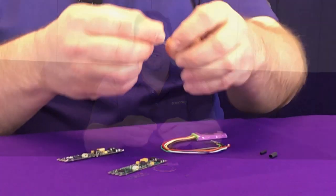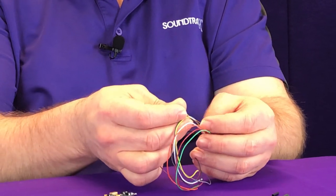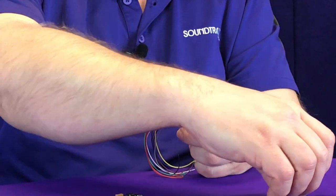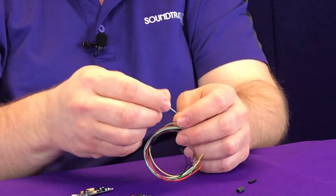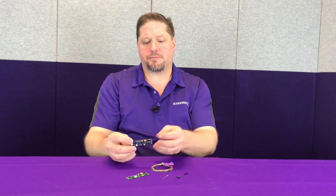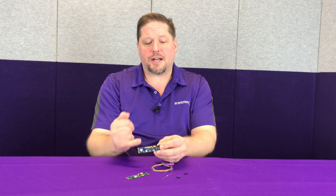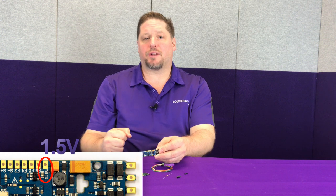The resistor, we just simply hook up inline on the white wire, and then make sure you get some insulative tubing and heat shrink tubing to slide over to protect your joints once you make the connections. On your PNP boards, these board replacement style decoders, we actually do have a plus 1.5-volt common that is pre-regulated for volt-and-a-half.